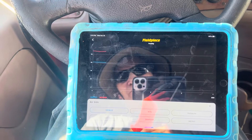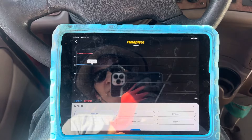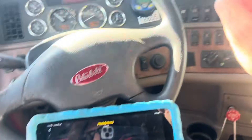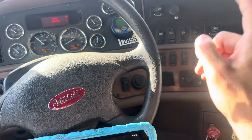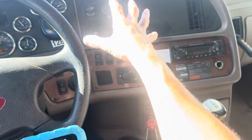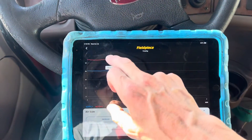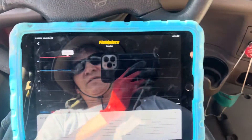What's this vehicle do on its temperature? I see the temperature coming down a little bit — nope, it's staying rock steady. This is not a variable displacement compressor, this is just clutch on, clutch off. Outside ambient temperature is 88 degrees.